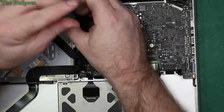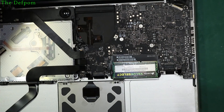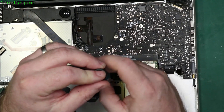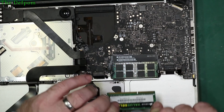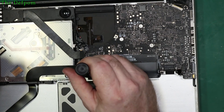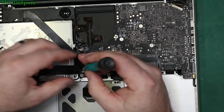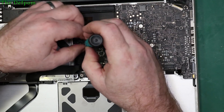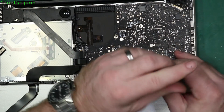I've got no idea what power rails are missing, I'm just going to go around, give it a clean up first and see what we can find. I'll pop this RAM out and get it out of the way. These RAM sockets are kind of fragile — there doesn't appear to be anything inside the RAM socket at least. It could be on the back of the module and the actual connections on the circuit board.